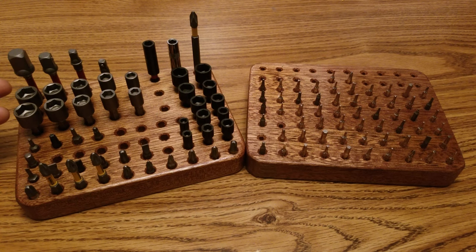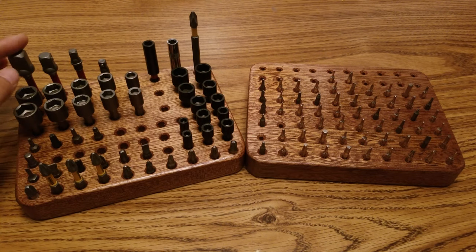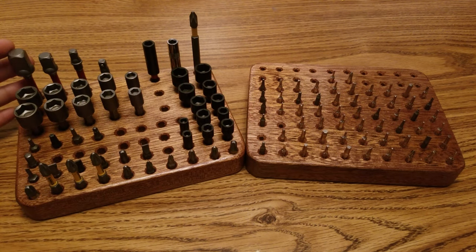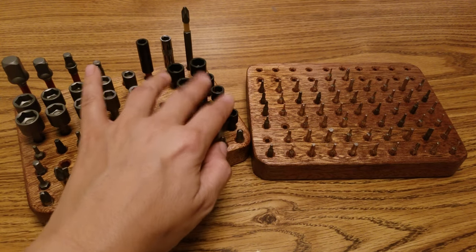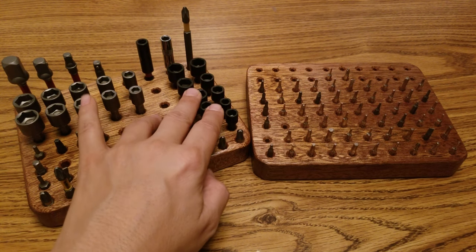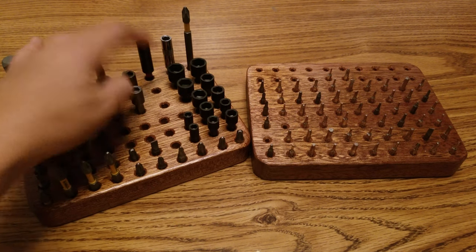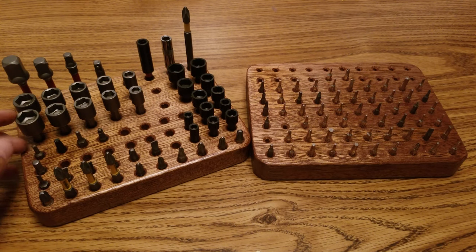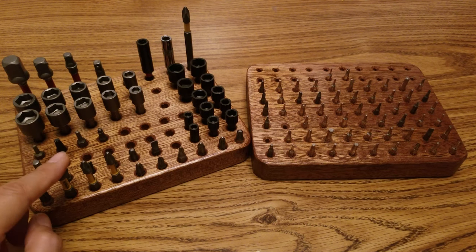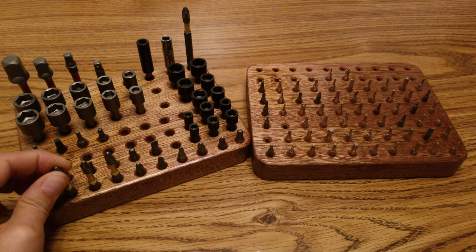This is how the bits generally look in the board. I try to put the tall ones in back. You don't want to create a hazard. These are basically for bench use and toolbox use. I didn't think I had this many bits — I thought some were lost but I eventually found them. I also got some adapters. Bits are consumable, so if you buy a set it's not going to stay a set. Phillips bits wear down fast — I helped a friend with a deck and used a lot of them. That's why Torx is used a lot now; Torx T25s work pretty well and save on your back too.